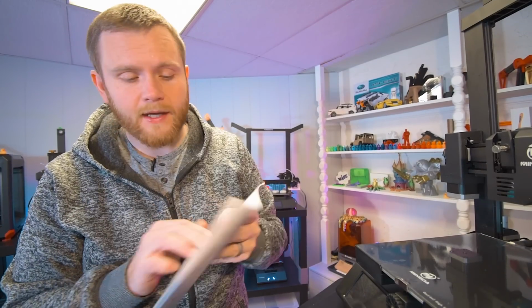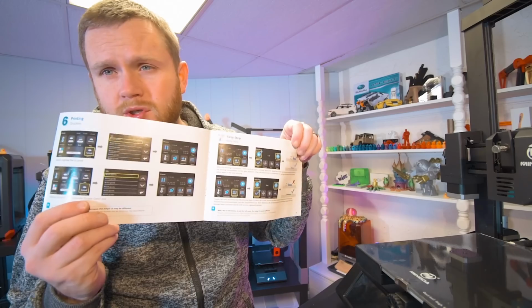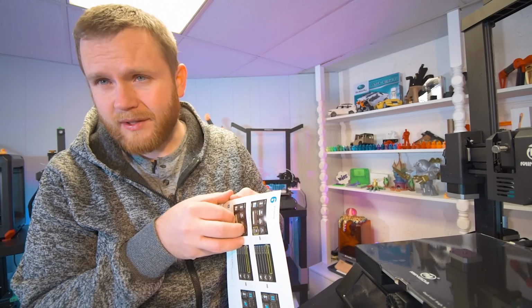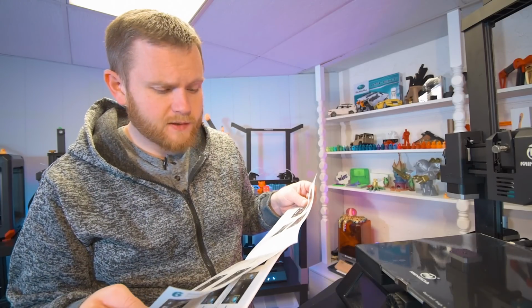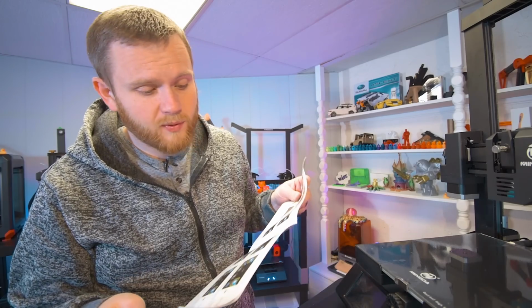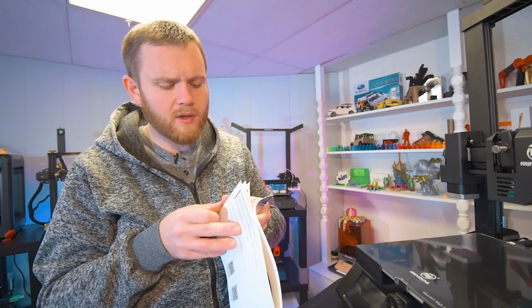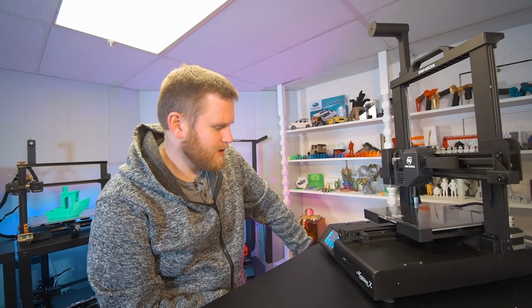I went ahead and took a look at the manual here, and it's actually pretty well written. Just pictures, really easy to understand what it does. It looks like there's a 1-button setup for preheating to PLA, one button set up to do the bed leveling. The ABL sensor will take care of everything else. And it looks like once you start a print, you baby step until you get the perfect leveling, and it saves that setting for future prints. Looks like it's really easy to use. This thing really has some magic tricks up its sleeve, the Magician X.